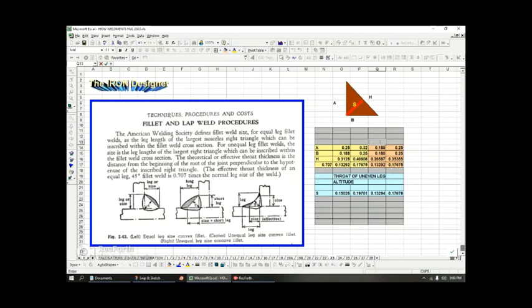So I'll just show you two examples. In one case, it's like a 3/16 weld, and in the other case it's a 1/4 inch weld, and they're nice, even, simple Pythagoras. You can compute the throat very simply. I mean, the hypotenuse is across here. You just square that, you add it to that squared, you take the square root, you get the hypotenuse, right, across here. And the throat, we just plug in our 70% rule of thumb. There's the formula, 0.707, which is really square root of 2 over 2 from Pythagorean theorem, times any one of the legs, and you get the throat, right?